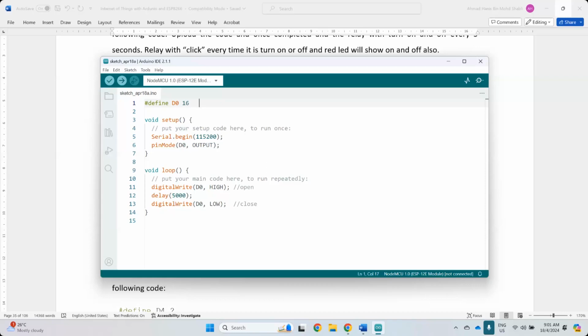I'll just learn the basics first. This one will require more understanding. I also use the Mini560 step down, which can provide 3A, if I remember. So 3A is able to drive servos, because servos require a lot of ampere to run under load, like the one that I have.